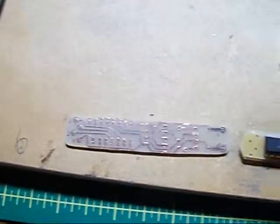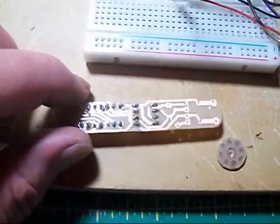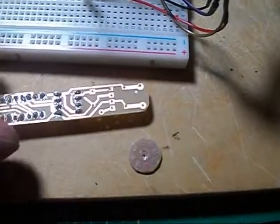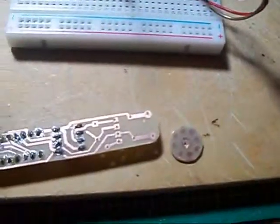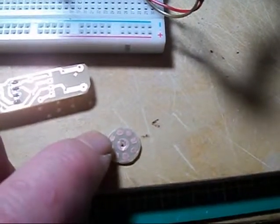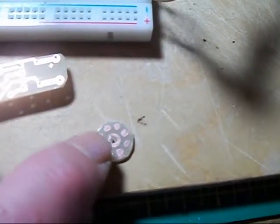You can see the board here — this is the bottom side, and here's the top side with the two components on there. I've got them soldered in but I still gotta add the resistors and the capacitor. This isn't too hard to solder, but those LEDs — that is a very delicate procedure, easy to screw up. I've already screwed up a couple before I finally got one right. The problem I found was soldering the anode side of the LED to the pad out here isn't too difficult, but the ground side — I couldn't seem to get a connection there and ended up with too much solder. It was just a mess.